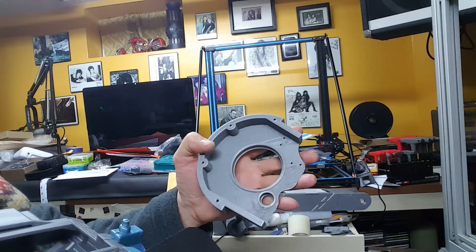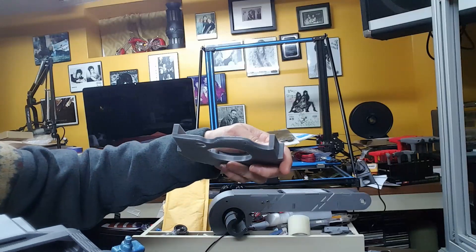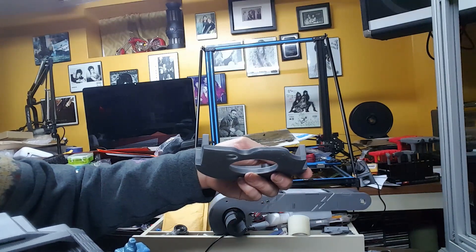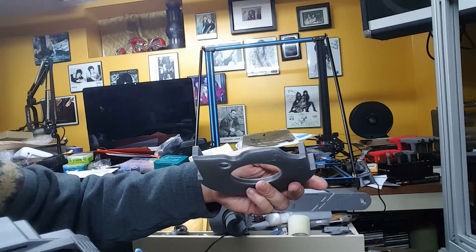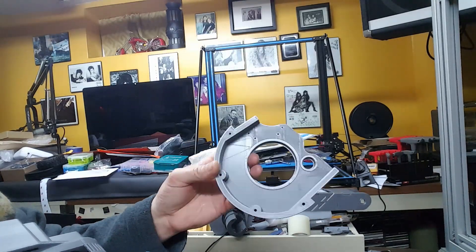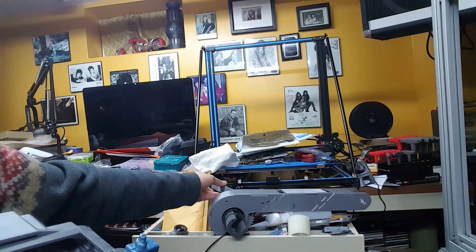Right now I'm reprinting another piece because when I printed this, the bed melted the bottom and warped it. I had the bed set at 60, and I don't know if it was because I was away and let the bed sit there for a long time after printing and the heat just got to it. I'm going to try to save this part — I may be able to use it as a spare. But I'm printing two new ones and this time I'm policing it like there's no tomorrow.